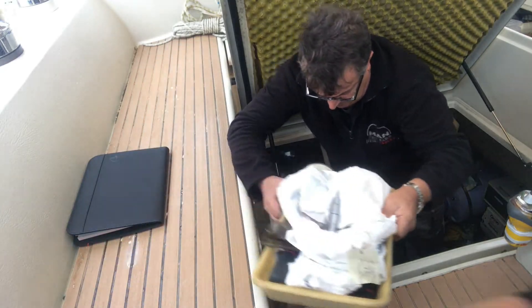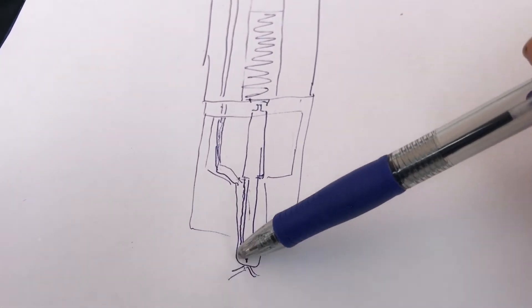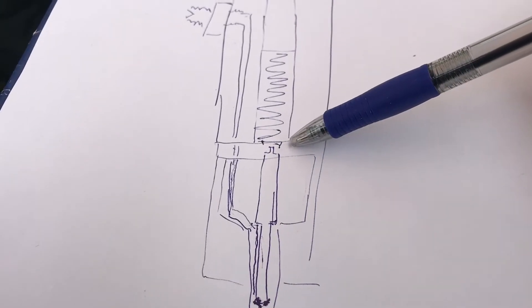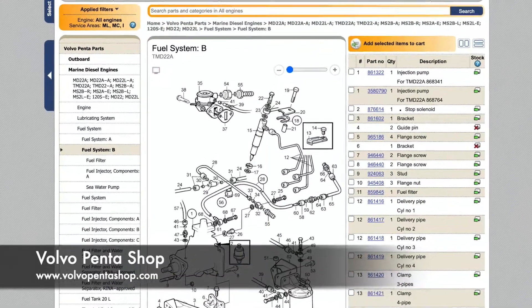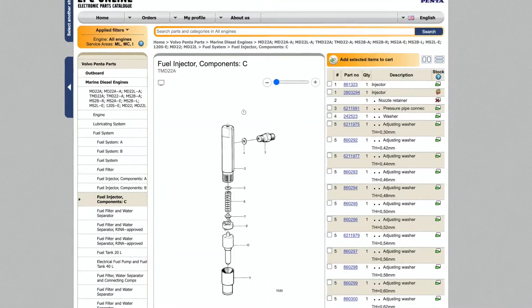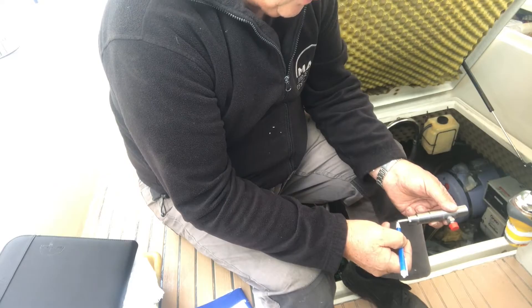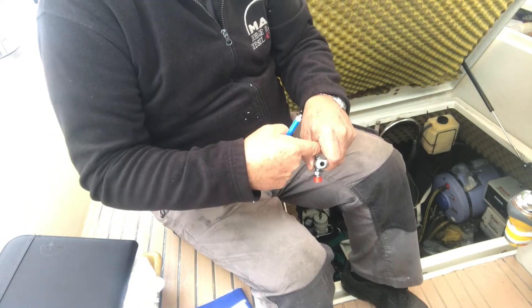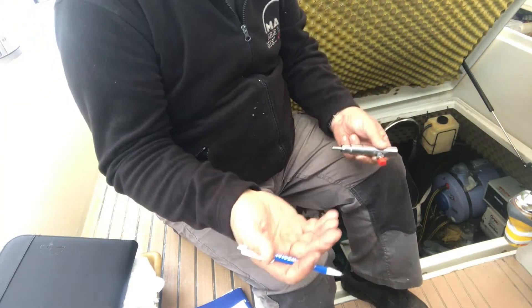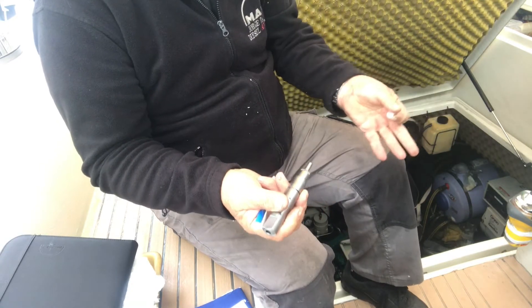When Jorge came back I got him to explain exactly what was going on with the injector. He explained that high-pressure fuel comes in, goes to the bottom, inside to the nozzle, and pushes through a small hole where high pressure pushes the spring to create a good spray. It's working with a good spray, but it's losing a lot of fuel between the needle and the body of the nozzle — leaking more fuel than normal for the return. This one has a lot of hours and is out of clearance, which is why it's leaking more than normal. Normally there must be some fuel as lubrication for the needle, but the spray pattern itself is still in good condition.